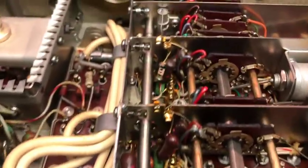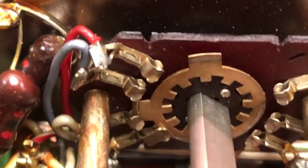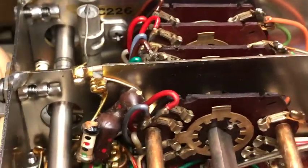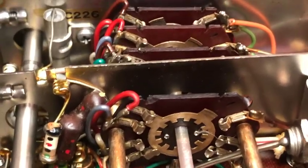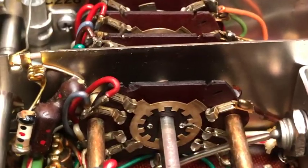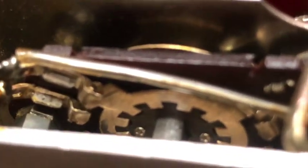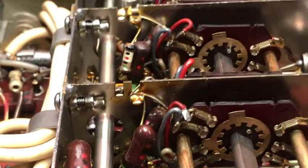I need to remove the RF deck again, which is really annoying — I was almost ready. Looking at the bandwidth switch, it seems that it's not well centered, and I did not touch this. If I turn the band switch it turns, so it is mechanically connected, but it seems it's not well synchronized. I wonder if it stops out of center. Especially here in the back, it's very difficult to see, but between these two ranges it seems it doesn't touch any contact, or barely so — I need to adjust this in a more precise way.